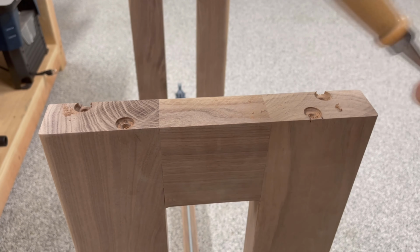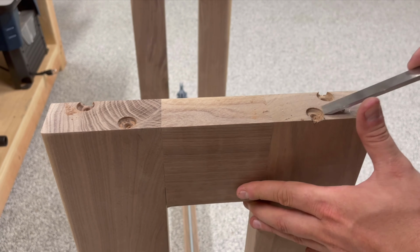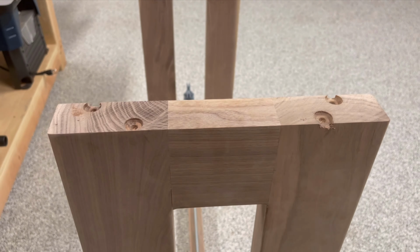To install these, you use a combination of a bit, whether it's a spade bit or a Forstner bit, along with the chisel to essentially countersink these figure 8 connectors into the legs that they're being attached to. Once they've been countersunk, you can come back through with a wood connector. In this case, I'm using just Phillips head wood screws, and you attach them in place. Once all the figure 8s are in place, I then flip the tabletop upside down and begin to center the legs and mark where I need to pre-drill, because in a later step, whenever I go for final assembly, I will be installing some wood screws after I've applied the finish into these pre-drilled holes.